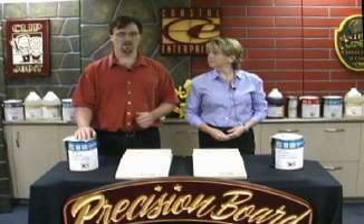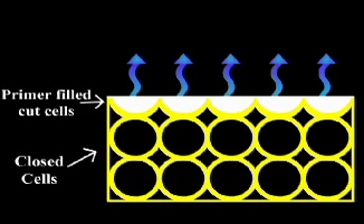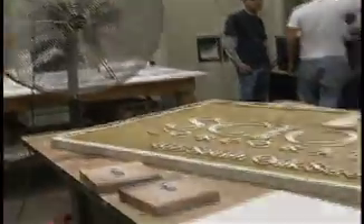You can make precision board look like wood or any other substrate, but don't expect it to dry like wood. The drying of FSC88WB or any water-based product is very important when working with precision board or any other substrate. Just like we talked about in the precision board section, precision board is a closed cell product and everything dries through the top. We recommend putting the primed piece under a shop fan for at least 4 hours before sanding. FSC88WB does dry faster than most other water-based primers because of the high amount of solids. However, drying time will vary in different parts of the country depending on heat and humidity.